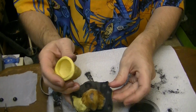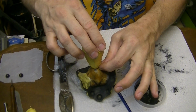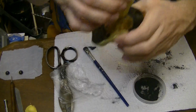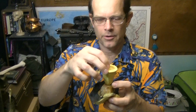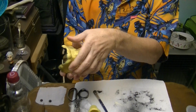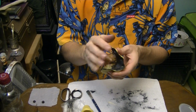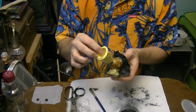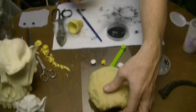Then, once that's done, what I'll do is I'll stick this here, attach it with more mold putty, and then what we'll have is we'll have a shell that we can pour material in from up here. Additionally, we're going to be adding a hard shell around the mold putty shell. So you've got two pieces of the mold putty with the part attached here. Then we add something like this, which we've done on our other mold.